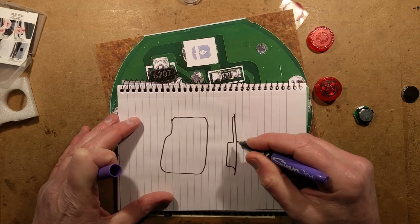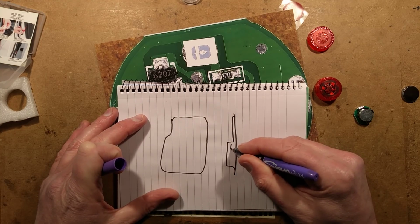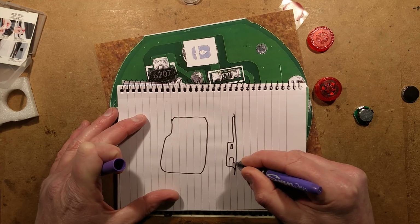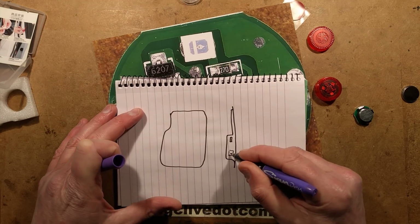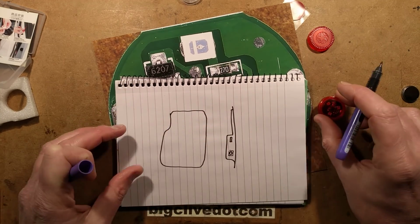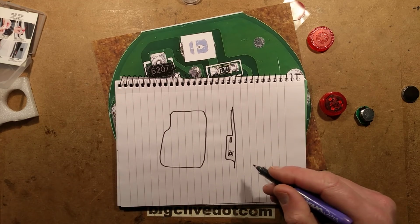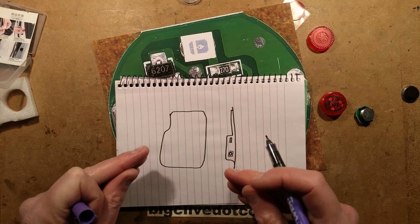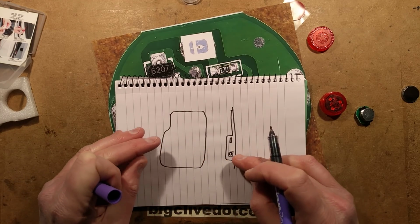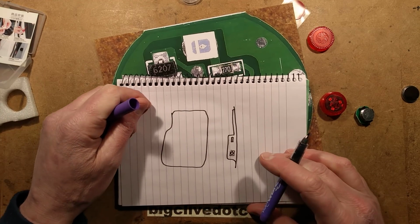A couple of places I found, in the edge of the door, there was the lock mechanism, and then down below there was this, I'm not sure what it's there for, but there was a very slight recess, and it was absolutely fine for taking the LED side of it. The magnet would then go in the matching corresponding side of the door. I suppose it would be worth shifting the magnet about, just sticking it on without the adhesive pad first, just to make sure that it was turning the LED off, although the door's kind of closed, so you're going to have to just judge that.